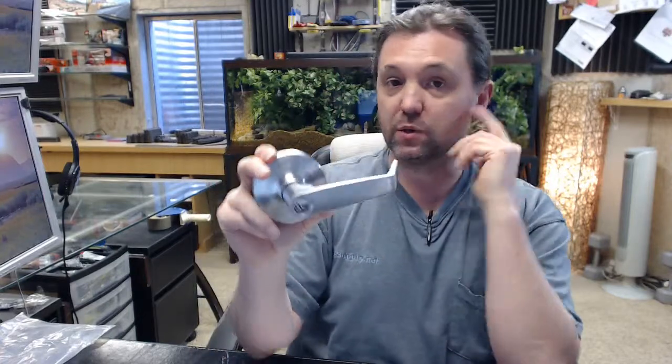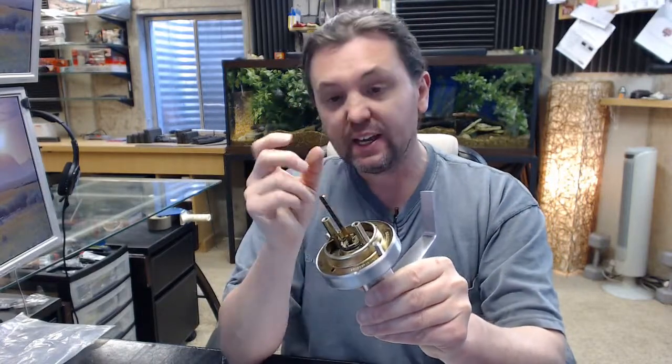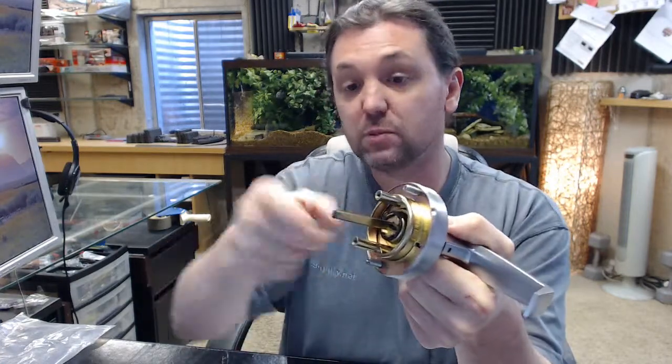Wide head panic bars from Ultra means that it's for their 02054 and 02055 exit devices, or those commercial exit devices that have the standard size head case — not anything very narrow like you might have in a narrow style exit device. This is an incredibly generic sort of design, and Ultra would have no compunction about you using this with other people's exit devices. There is nothing about this that would tell me it's incompatible, except that the tailpiece on the inside of the head might be too large.